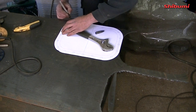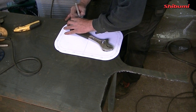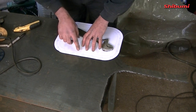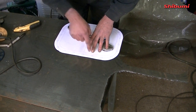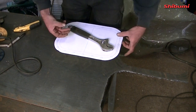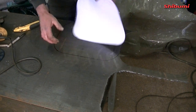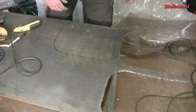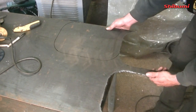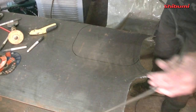Another very simple way of doing this would be to use a tin of spray paint — it would just leave the shadow as your cut line. Then I'll put a template back on top of one of them, tape it down, dot-punch all the holes, and when they're all clamped together I'll chain drill them all the way through. Seven times four is 28 millimeters of steel, so they're going to take a while to get through.